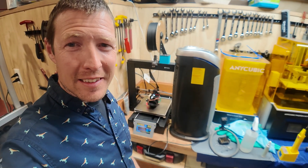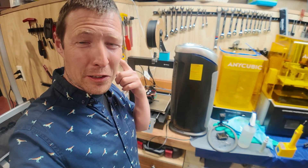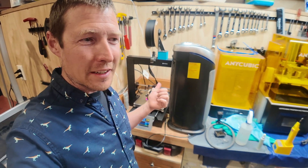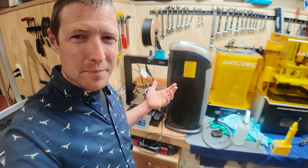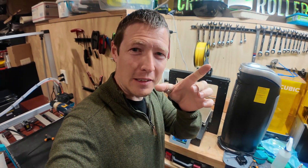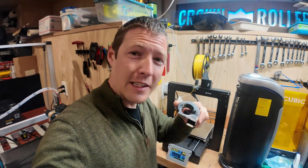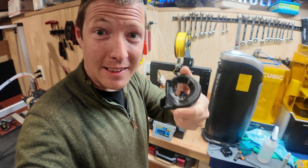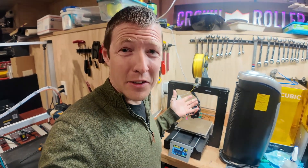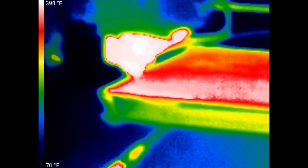I can now print PPS carbon fiber and PA6 carbon fiber. As long as I keep this carbon scrubbing fan on, hopefully it'll keep the odor down. The activated charcoal filter will help with the majority of the bad stuff. I've removed the fan blower housing around the nozzle — when I didn't do that and it hit 420°C it started burning. It's heating up — almost 800 degrees Fahrenheit — set at 420°C.